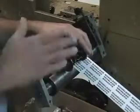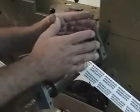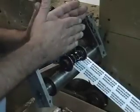Now, I don't know if you guys had these things backed off from here or anything like this, but I see a disparity in the pressure of the springs. That's already telling me something. But let's forget about that, and let's just talk about how we might set this in a way that is teachable, predictable, makes sense, and puts the minimum amount of stress on the spring and everything.